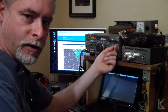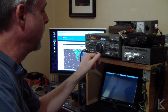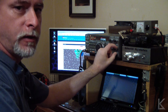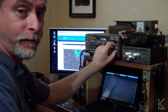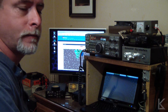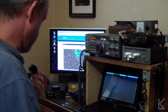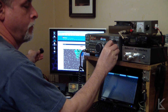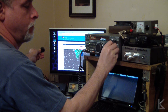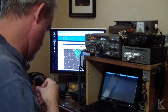I was tuning in for the Little Red Barn Net here in northern Indiana, which is just finishing up. I'll tune off of them so you can hear this. Let me turn down the RF gain. You hear that whine? Let me put the microphone near the speaker. There's a whine on my audio.